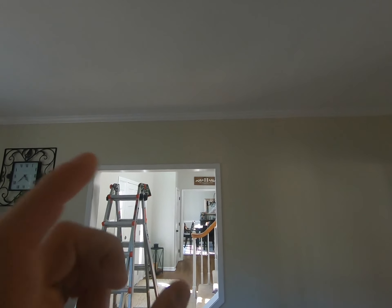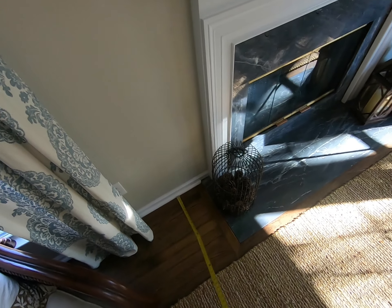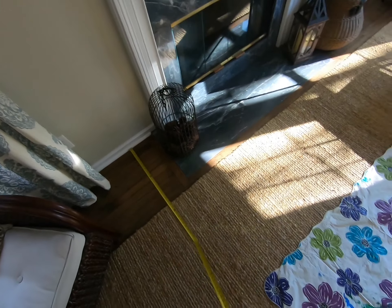If you don't have crown, that's not a problem. All you need to do is cut out a corner section of drywall that exposes both the stud and the plate at the same time, so you can drill through it and run your electric wire. First, find the center of the room — that's where the light is going to go.